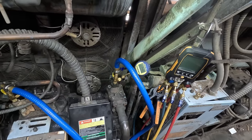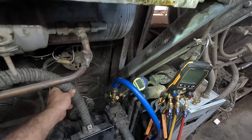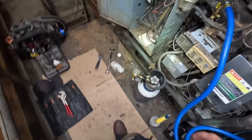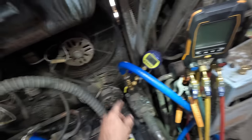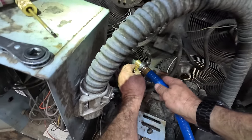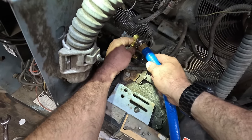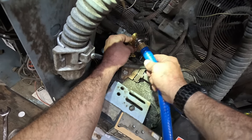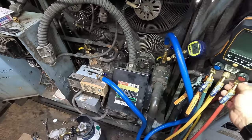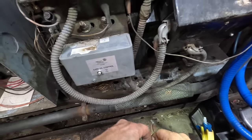I've tightened everything you can tighten. Sprayed all the fittings. I'm normally not a big fan of multiple sweeps with nitrogen — triple evacuation type deal — because of the hoses I use. But we're going to isolate the system, purge nitrogen through it. I've got the contactor just connected so that the solenoids can stay energized and the system hopefully will sweep. We don't want to go high pressure or anything like that — we mainly just want to sweep it. Either I have a leak or there's that much crap out of the system. Normally it never takes this long.